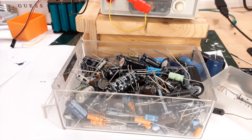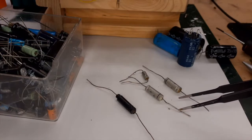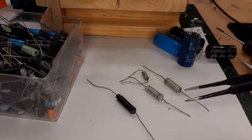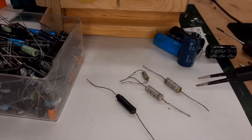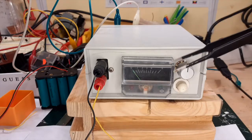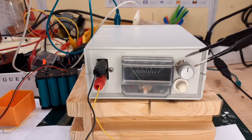If you have used or stored stock of capacitors purchased a long time ago, or you want to use a new-old-stock capacitor to restore an old device without inserting new modern components, it may be necessary to check if the capacitor still has its blocking capability for direct current, or if it has a leakage and allows direct current to flow. The instrument shown today is used to measure the leakage current of a capacitor.